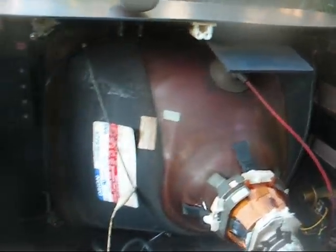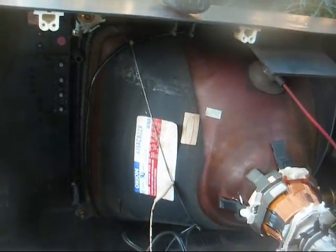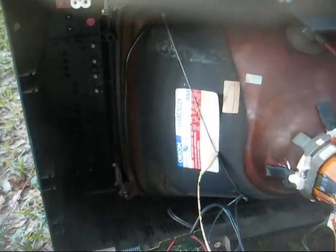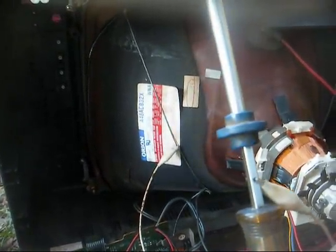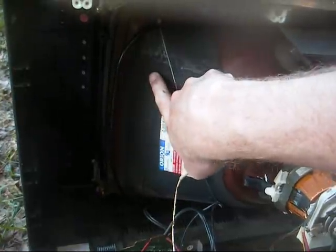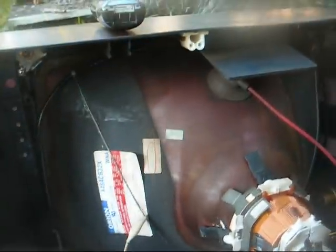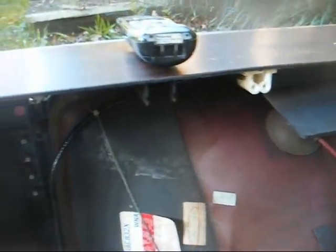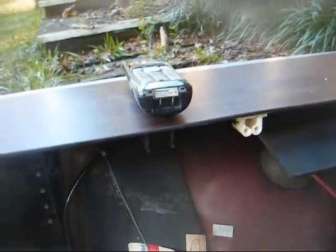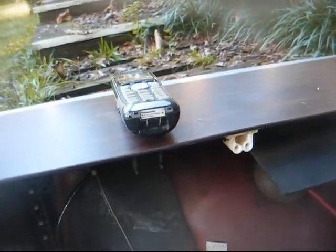Now before we go grabbing the second anode connector up here to disconnect it, we need to discharge it, just in case there's still a charge left on the tube. So the way I like to do that is just take a screwdriver and attach a clip lead to it, and then attach the other end of the clip lead to the dag ground strap here on the CRT, and then slowly run the blade of the screwdriver under the suction cup and make contact with the connector. And depending on how charged up the tube is, you might get quite a loud snap, pop, spark, but you really need to discharge the tube before monkeying around with that anode connector.